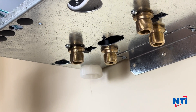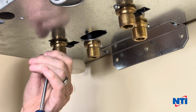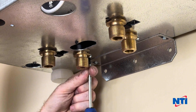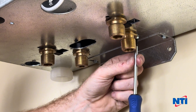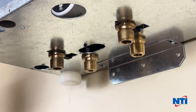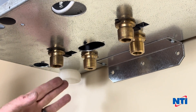Now that we've removed the relief valve connection, we have to remove the four screws that are holding the IWC in. That requires a T25 screwdriver, and these screw up into the plastic bosses on the bottom of the IWC. You do not have to remove these brass fittings or disconnect your plumbing. Pay attention to these two plastic squares — those are used from the inside to lock the IWC in place before you put the screws in. There's a little key slot that they fit in; once we unlock those it will allow the IWC to pull up and through. Until you unlock these, the IWC won't move.